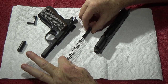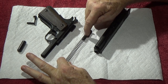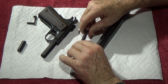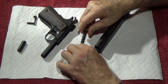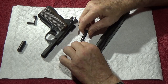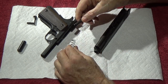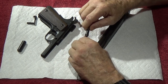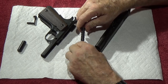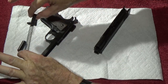Never just pull one of these springs straight off the guide rod — you'll expand and ruin the spring. To remove it, turn it one way or the other and see which way feels softer. Turning it clockwise expands the spring so you can take it off without hurting it. Same thing to put it back on — clockwise to expand. That's the best way to take care of your springs; they're a big function of a 1911.